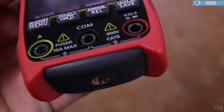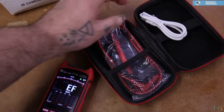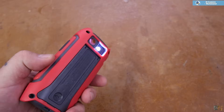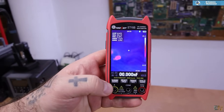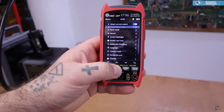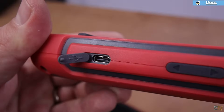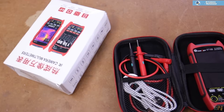It is CAT 2 up to 600V, you can easily access the fuse to change it, and it also has a flashlight on the back, which might be useful. The screen is quite big and that might drain the battery quite fast — I'm guessing that's why they use a dark background, to reduce battery usage. It also has automatic power off. Links for this device and everything in this video are below in the description as always.